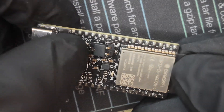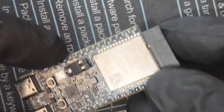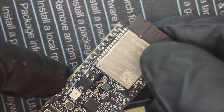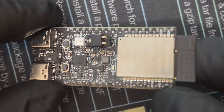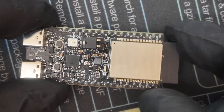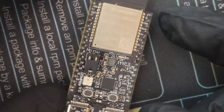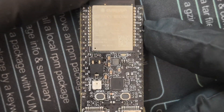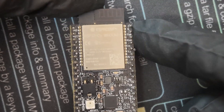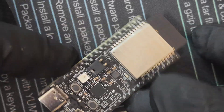To use our C5 War Driver we're going to need an ESP32 C5 dev kit. The ESP32 C5 is a 32-bit RISC-V single-core processor with clock speeds of 240 MHz. There are two iterations of the C5 dev kit: one with no UFL connector and another with a UFL connector. Just Call Me Coco typically designs his boards so you can print different cases to attach an SMA antenna and give your ESP32 C5 better range.